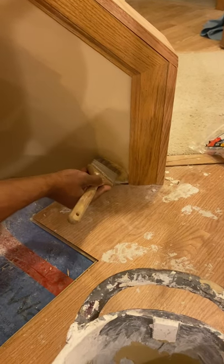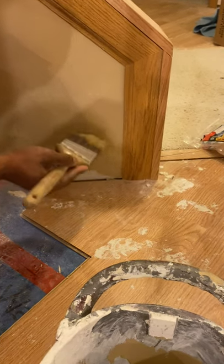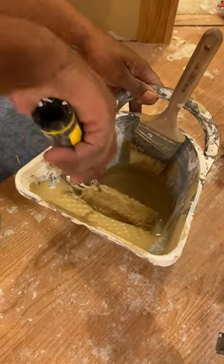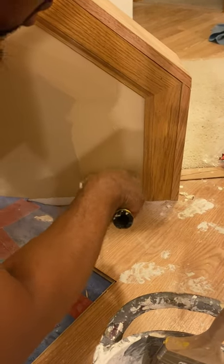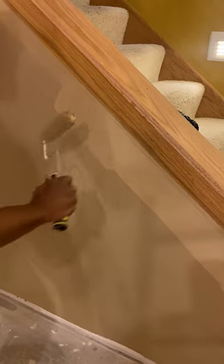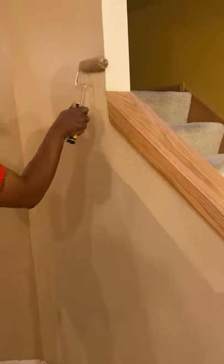Around your trim or your doors, at the bottom of the floors — because a lot of people get lazy, they don't want to go down and paint the bottoms because they don't want to get on their knees. A little bit of paint stretched out. I'm going to brush-roll in our brush marks. Only about a quarter inch of space. This is what I do.